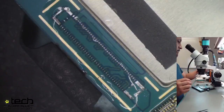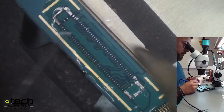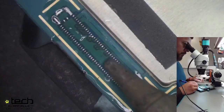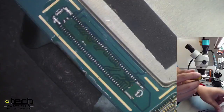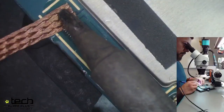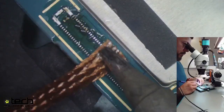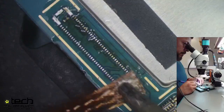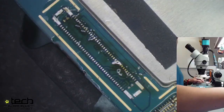He's applying a bit more flux. Now the second step is cleaning the old solder off the board and putting new solder on. He's taking the flat tip of his iron and touching each of those pads, adding a little bit of solder. Less is more here — too much solder causes bridges where pads are touching that shouldn't be, or clumps that won't let the connector sit flat. Now he's using desoldering braid under the iron — it's made of copper wire which absorbs solder. The reason he applied new solder first is that fresh solder melts at a lower temperature, making it easier to wick up the old solder.